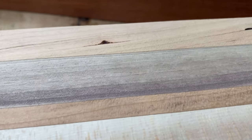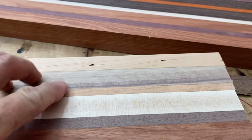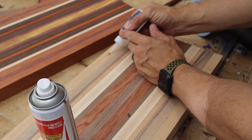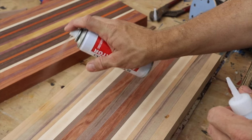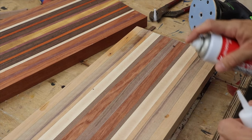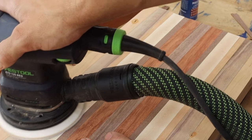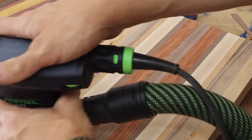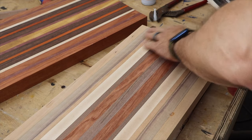You may notice a couple of knot holes or even little splits in your wood. You can easily repair those with CA glue — I use Starbond, clear here. If I was working with walnut or a darker color, I'd use brown or even black. Very easy to use: put it in there, spray the accelerator on there, and it dries within about 30 seconds. Then take your sander, sand it back flat, and it fills those holes — they're sealed and won't split again. I'll put a link in the description to Starbond if you're interested.